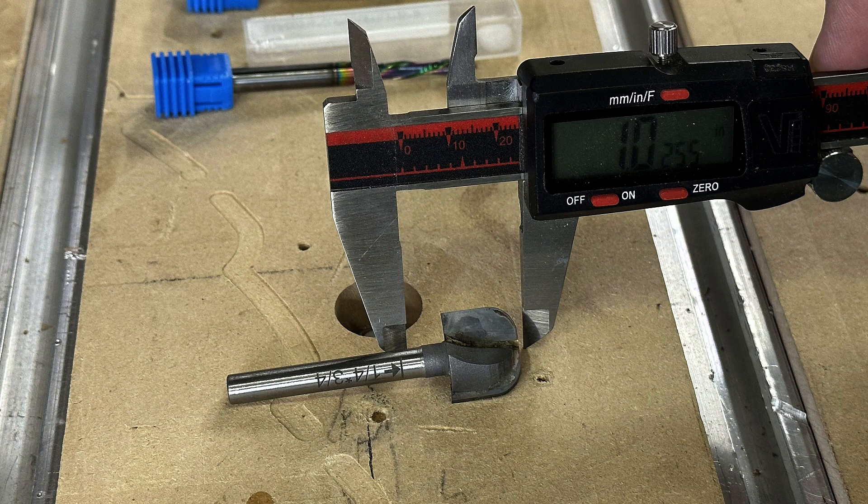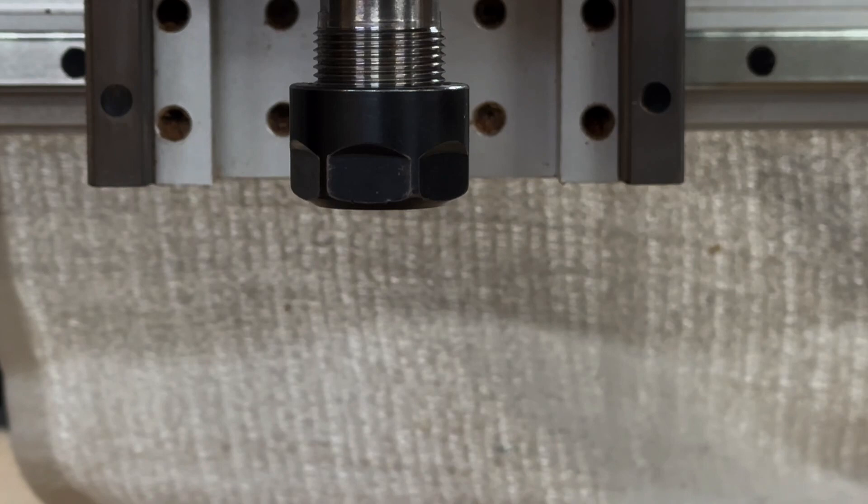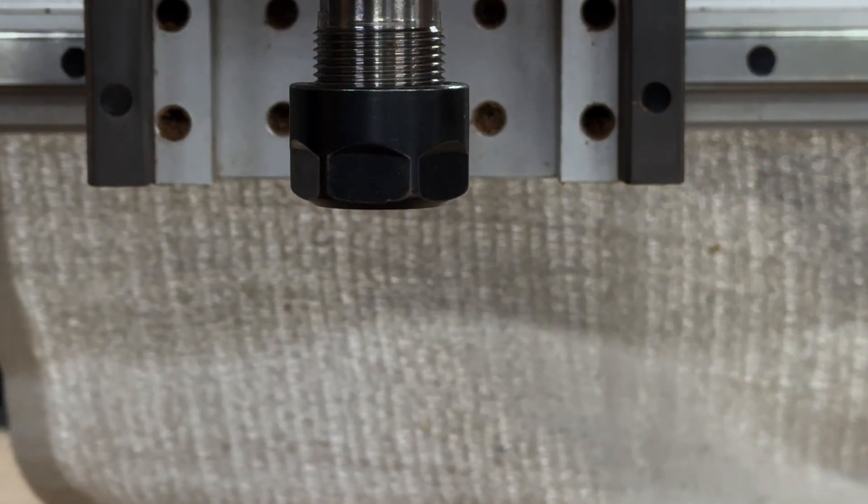To determine carving depth, you have to measure it with a set of calipers, then measure how far the bit is going to go into the material, and bring that back to your Vectric or other CNC design software to decide how deep you can cut without having the collet hit the top or side of the material. Let's walk through inserting a bowl bit and making sure it's at the right depth, then measuring how deep a carving you can put on your material.